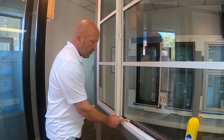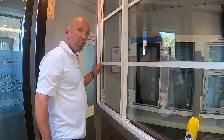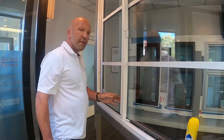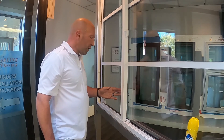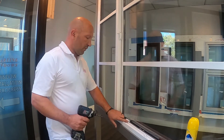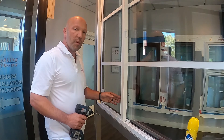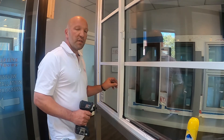To engage the night lock, you just depress your finger into that lever, and that allows you to leave your window open at nighttime for a little added security. You can never trust a night lock for major security, but if you want to leave it open just a crack for your cat to get in or whatever — voila, you're done. That's how you properly install your 6000 series night lock or vent restrictors on your sliding windows.